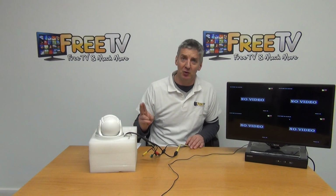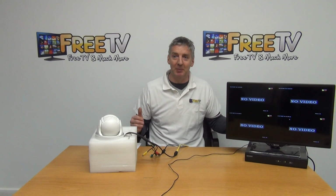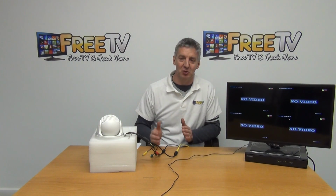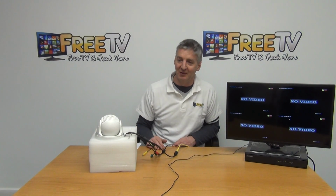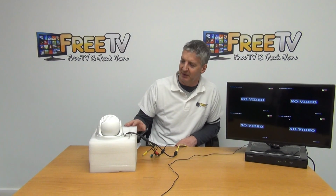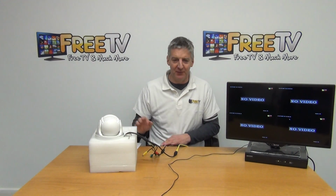Okay, and we do that for two reasons. Number one is that if we don't do this, it might look like a pair, but it can't successfully pair. And the second thing is it just makes it much easier if we're using the same password on both the DVR, and this is a hybrid DVR, by the way, so that's why it can handle IP cameras, and the PTZ itself. So that was the first part of the setup.